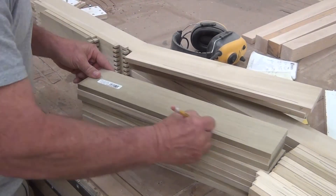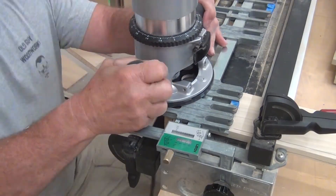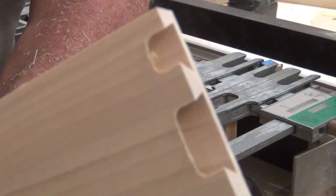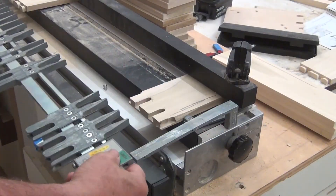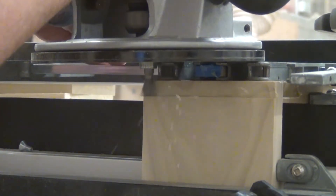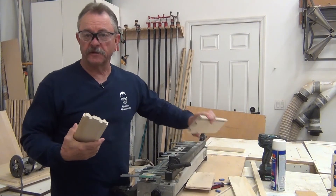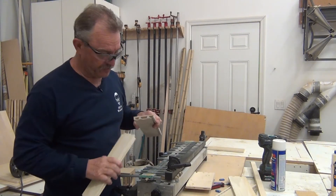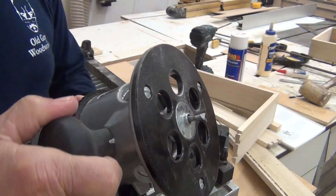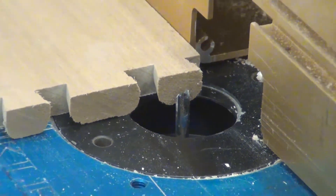I always mark the bottom inside of all my pieces. When you use this jig you have to have the inside pieces always facing up or out. A little score climb cut gives us a nice clean edge. For this project I'm making eight drawers and I'd love to cut all the parts at once, but I stop partway through and test my joinery to see how it's fitting and then make adjustments. Adjusting the height to the cutter adjusts the size of the pin, and moving the template in and out adjusts the depth of the socket.